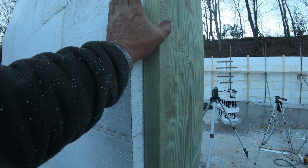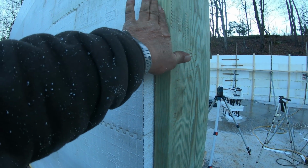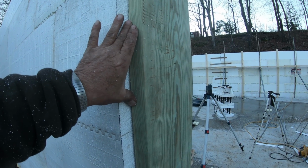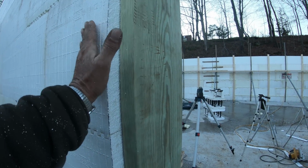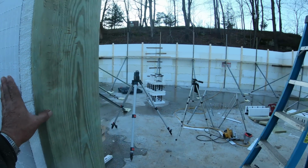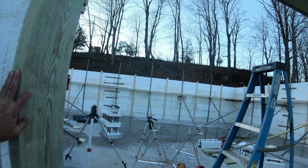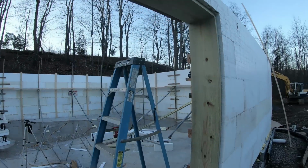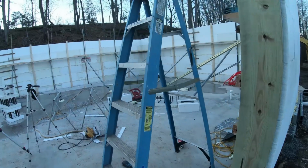It'll keep that corner from breaking off, and I think it'll look nice to have it just rounded in. So I'll custom cut pieces in here. Once the door is hung, I'll custom cut pieces that will round over, and then I'll just parge it right in like that. I think it's going to look nice that way. I still have to secure the outside of this thing temporarily till we get poured, and I have to finish up there too, the same thing. But that's basically what this is, a doorway for that glass door.